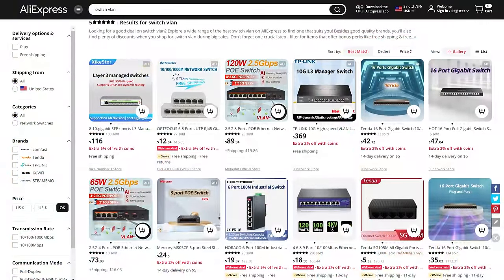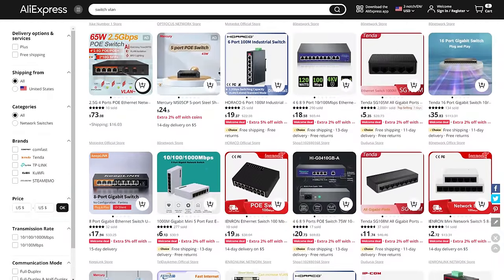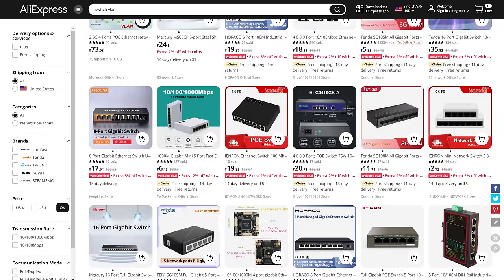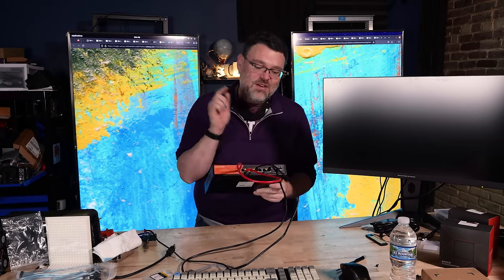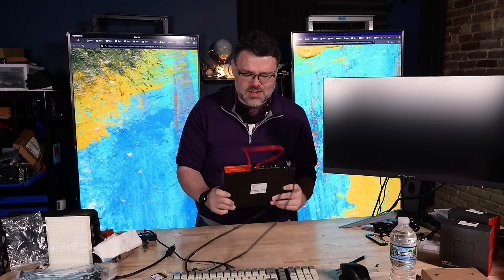There's not really much else to say — it's an ethernet switch, you plug it in and it does stuff. If you need eight 2.5 gig ports, this is great. If four 2.5 gig ports is enough, the version with dual 10 gig might be better. There's also a version on AliExpress with VLAN support — a physical switch to preserve or not preserve VLANs — but it doesn't handle VLANs through a web GUI, so if you have complex VLAN infrastructure, maybe don't. Otherwise it's a dumb switch with a 10 gig uplink for less than $100, though you'll probably spend $30–50 on the 10 gig SFP adapter itself.